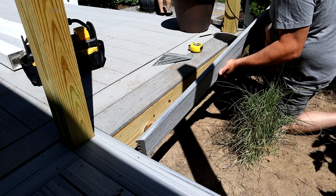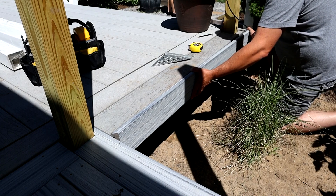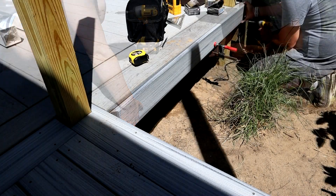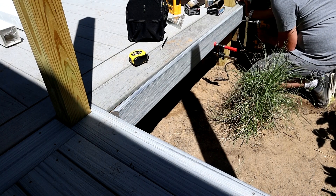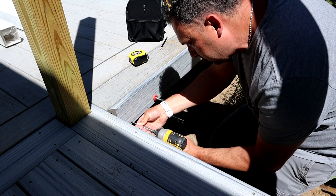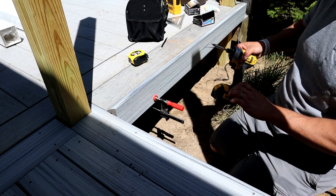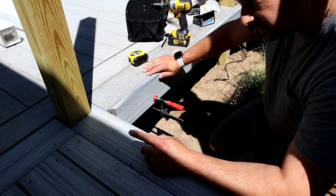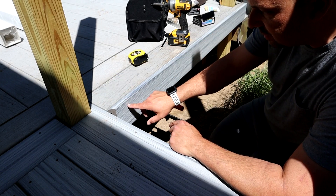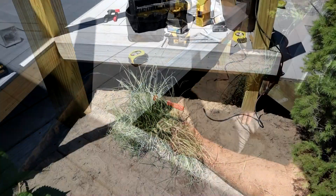Got to put the skirt boards and the lattice on the side of the deck here, so I just cut this thing to size, mitered the ends of it, and that's just going to go right on the edge here like this, flush with the top of the deck. Just going to continue measuring this out, finish screwing it in. Keep in mind here — easy mistake to make — don't forget that this board is flush with the one up here, so you can't be driving a screw at your normal spots because you'll be drilling right into the deck board. So I'm going to bring those down a little bit. That's all screwed into place.